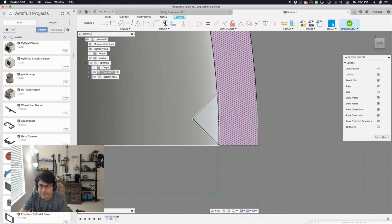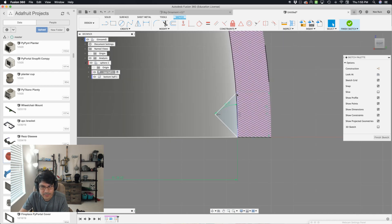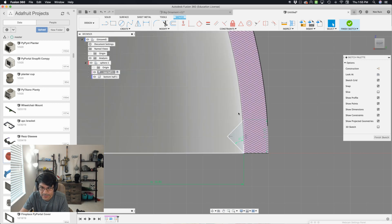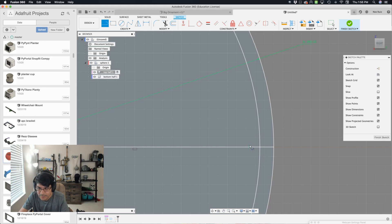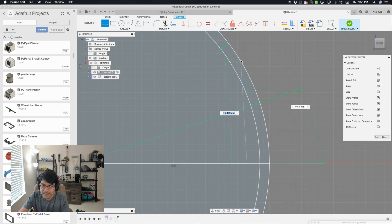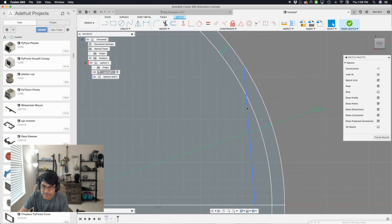So I can go back into this dimension and say I want it to subtract from the thickness: diameter divided by 2 minus thickness. And you can see we're right where we need to be. But if we look carefully, because we're dealing with a sphere and not a cylinder, it's not perfectly straight. So we need to add a little bit of material to our top half so it straightens out and just goes straight up. We can go into our first sketch that created the revolve and use the line tool to create a line that goes straight up, making it coincident at both endpoints.